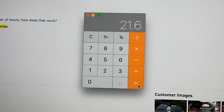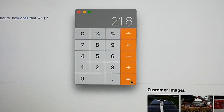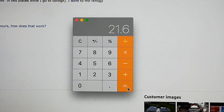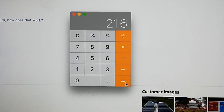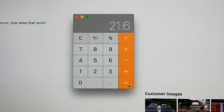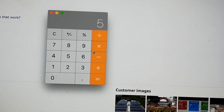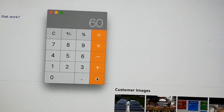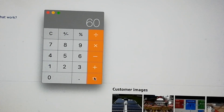Another way to think about this is to convert to Watts: Watts equals amps times volts. Voltage is 12 volts and I'm getting 1.84 amps, so that translates to 21 Watts. These panels are rated at 100 Watts, so I'm only getting 21 Watts — about one fifth of what they should deliver. Five amps is the norm, so five amps times 12 volts is 60 Watts, and I'm still only getting a fraction of that.